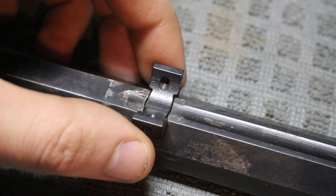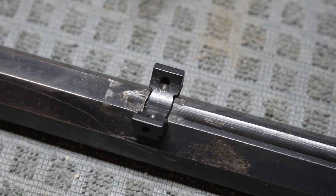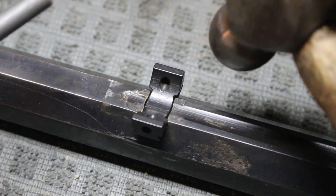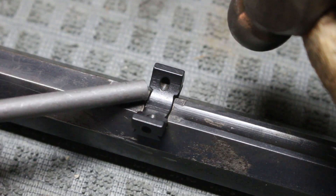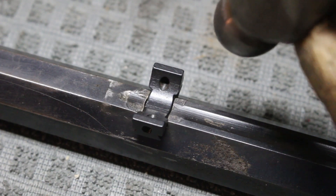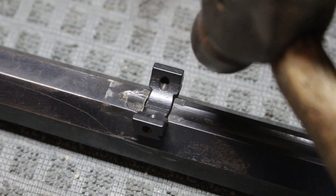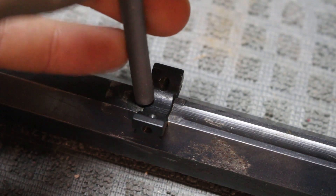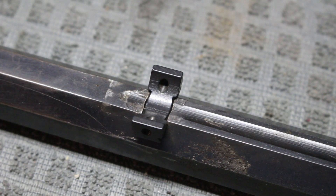Let's get to the methods. Method number one would be using just a ball peen hammer, and you'd want to just slightly curve in the dovetail edges just the slightest bit inside so that it tightens it. This doesn't cause any damage to the firearm whatsoever — you can't even see it. The second way would be to take a punch and do the exact same thing — beat these edges in. This also doesn't cause any harm; you're just displacing metal, not chipping anything off.